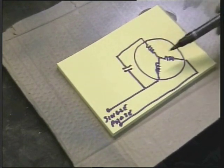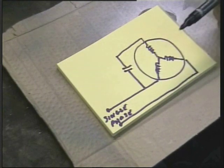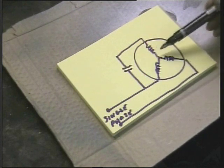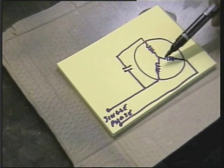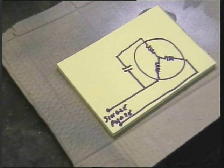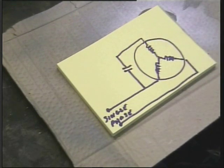But this capacitor will cause unequal currents to flow within these coils and they will slowly heat up. If this capacitance is low, that won't be too high. But we need more capacitance to start the motor. If this were a higher value, such as 160 microfarads per horsepower, this motor would immediately start and run away, but the coils would overheat and the motor, in a few moments, would burn out.